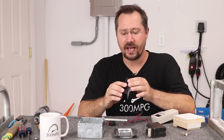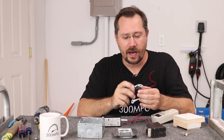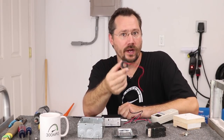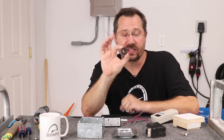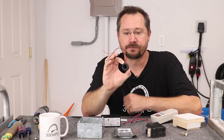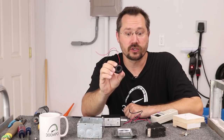On the side it has four wire inputs — two for power and two for this little current sensor device. It's a coil that goes around one of the wires from the solar. Any time there is an electric current, a flow of electricity, it makes a small magnetic field. This device picks up that magnetic field and turns it into a signal. The stronger the current, the stronger the magnetic field — they're directly proportional to each other.